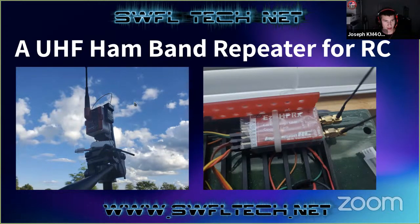This is a little repeater setup. So I've actually built a repeater for this. What it does is it takes the 2.4 gigahertz signal. It's got a little receiver on here for that, and it actually converts it into a PPM signal, which is a pulse position modulation signal. It basically sends all the channels from the transmitter over a single line, which goes into the back of the UHF module. And that is rebroadcast over the UHF module with much more power and a lower frequency, which is picked up by the truck. So it's a little repeater system.